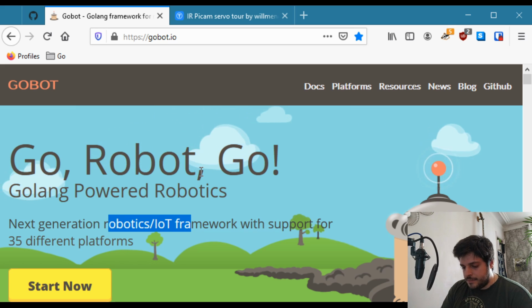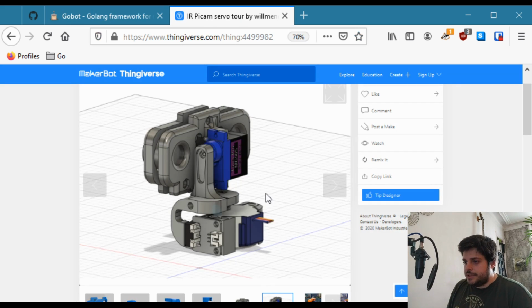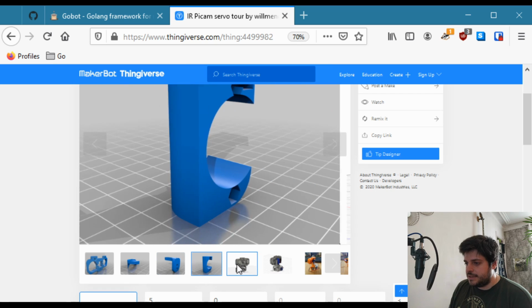So what I've printed out, I've shown you previously, this little tower with the infrared Pi cam. We've seen how to use the servo motor. Now there's a stepper motor underneath, and the idea is that this will rotate the camera. It's a much smoother move, but we do need a little switch on the side, just like 3D printers and all that, just to tell it where the zero point is. So you can find the files on Thingiverse. I'll put the link in the description where you can print the different bits.